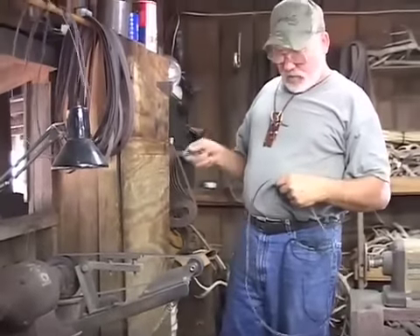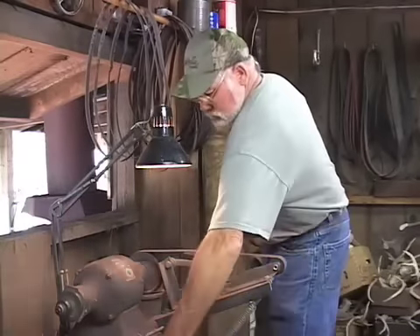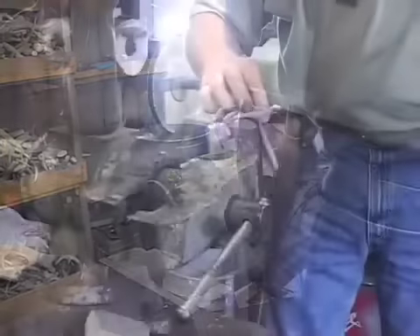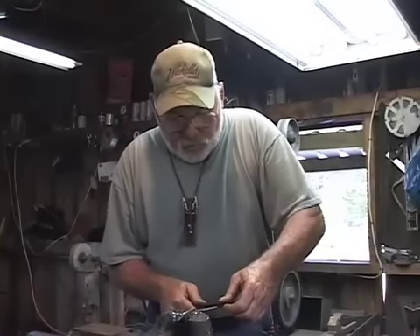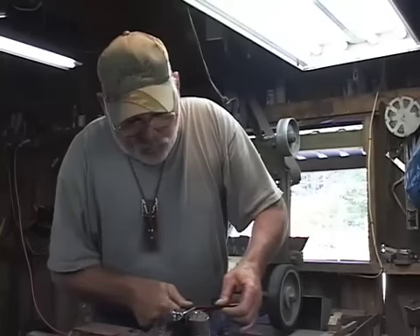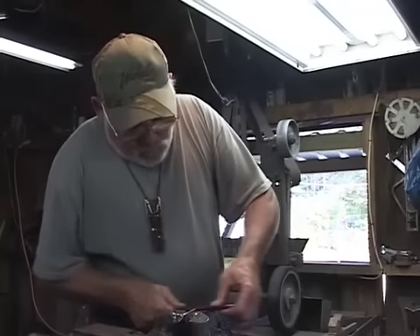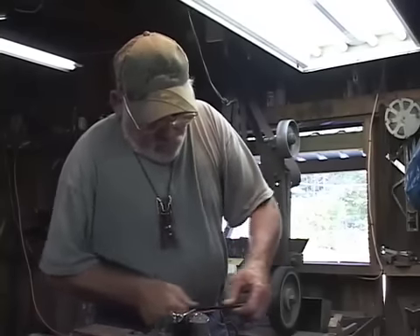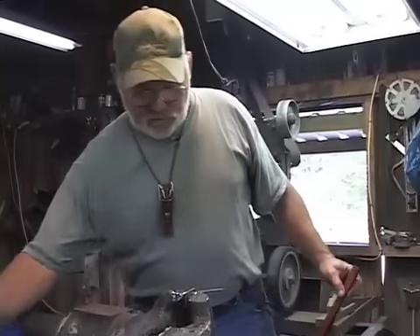I started off with a 36 grit, went to an 80 grit, now I'm going to go to a 220 grit. I'm going to wire brush it. The time you build five of these in one day, you've done a day's work. Now we're fixing to hand sand. The time-consuming part is doing the handles — when you start putting deer antler handles, micarta, and different types of exotic hardwoods, and if you start doing inlays with turquoise and malachite, different materials, putting guards on it out of brass and nickel silver, and even steel guards, you can put a lot of time into one knife. You generally get out of it what you put into it.